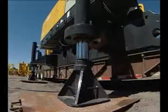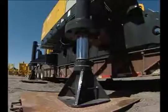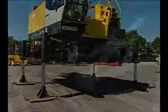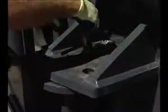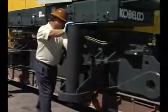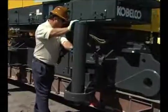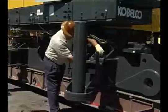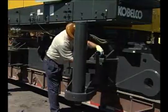The machine is equipped with hydraulic jacks called translifters to lift the main machine up 42 inches for easy loading and unloading from the transport truck. To operate, first remove the swing arm locking pins and place them into the empty hole next to it. Swing the translifter arms out to the working position and the locking pins will fall into place. Make sure all 4 locking pins are fully inserted and spring pins are installed on the bottom side of the lock pins.